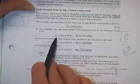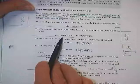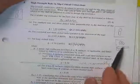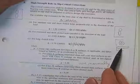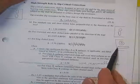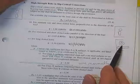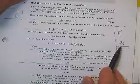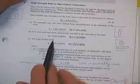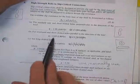Darn, look at this. You get a resistance factor of 100%. It's that consistent. For oversized holes, we don't use them. Long-slotted holes, here's oversized holes, here's long-slotted holes. You do these because once you get this whole thing put together, you're not sure where the bolt holes in the other piece are going to be. So you just got to have a little slack, a little room in there to make sure the bolts go in the holes, in which case you have worse resistance factors.